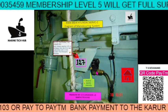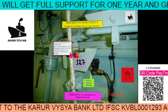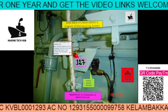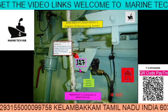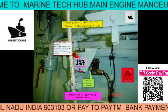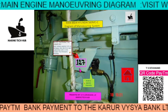An electric signal will come and activate this. Once it is activated, this signal will go to the puncture valve to stop the ship. If you click on the speaker icon, you can hear what this component is. Position number 127 is a two-position three-way solenoid valve. The function of this solenoid valve is to actuate the puncture valve on the fuel pump when a shutdown signal is given from the safety system.